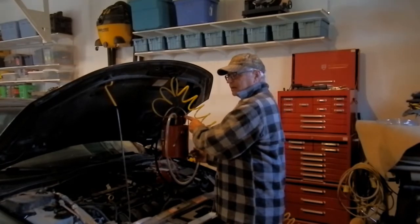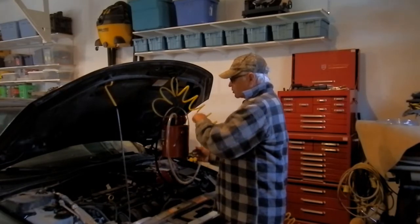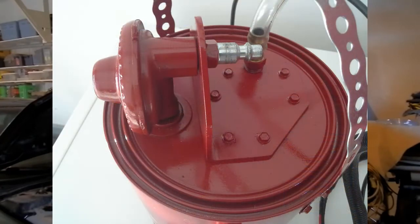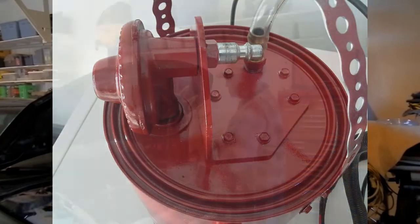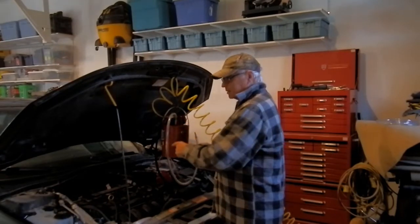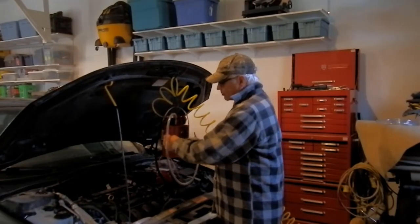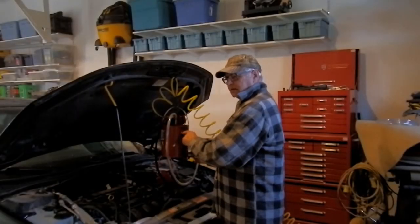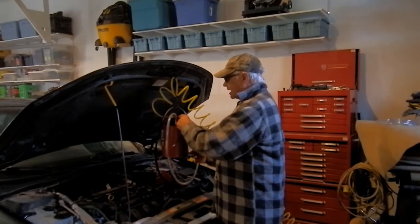So I kept everything inside the can. There's tubing that goes from this small old barbecue propane regulator — this one's a 90-degree one, that's why it fits like this. This bracket is just hammered out of a piece of 10 gauge aluminum. Rubber grommets go a long way on a project like this — there are rubber grommets everywhere. I also took the handle that was on this can and made my own out of three-quarter inch strapping.